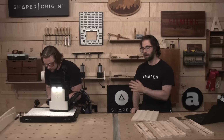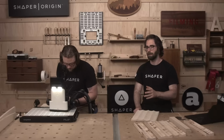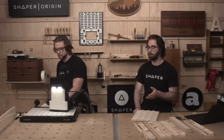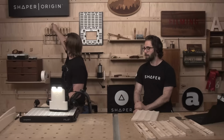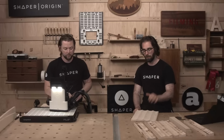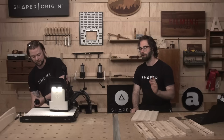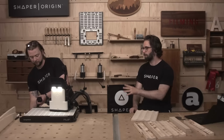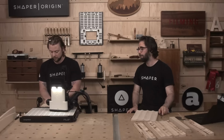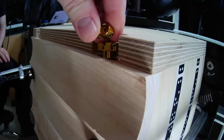I've done this a bunch of times, and this project is designed for this flute radius and this flute depth. But if you end up using a different router bit for these flutes, you might get a deeper cut, and based on the placement of this hinge here, because those flutes are cutting into the hinge area, you don't want to blow out that door. I would just say make an extra stave and do a test cut before you commit to cutting the door. The files are set up pretty specifically to trade off hinge clearance with flute clearance. Those are the two things that are going on.